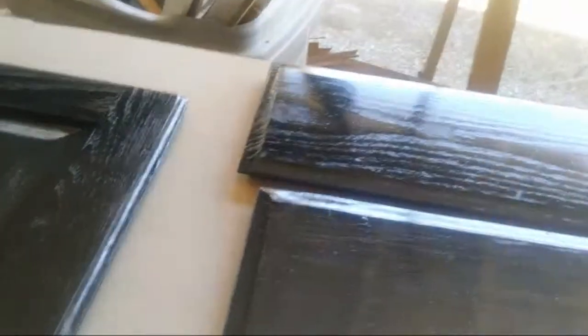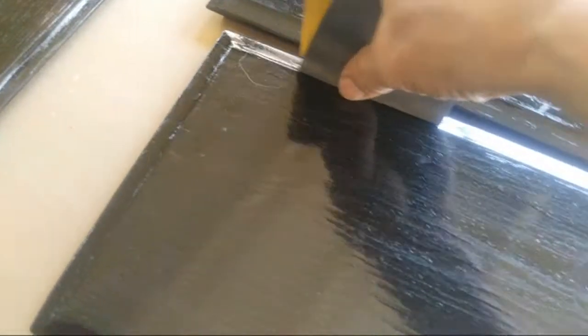Okay. And you use the same technique if you were doing your door in your house or your bedroom door, any door, when you're staining or sanding. Although if you're sanding, you can go back and forth. But all we're trying to do is knock down any roughness from the wood grain rising or raising with the stain and creating a rough surface on your finished stain. All right.